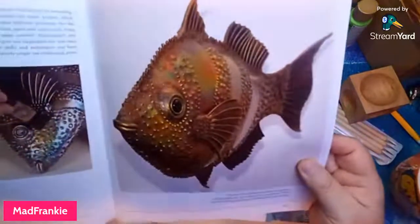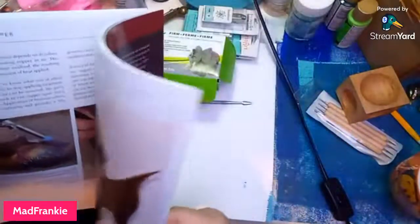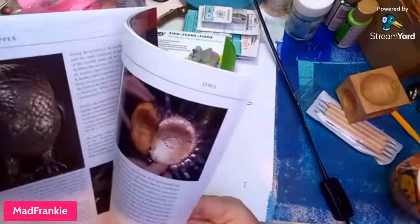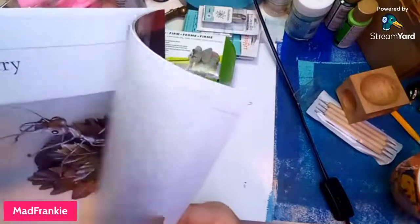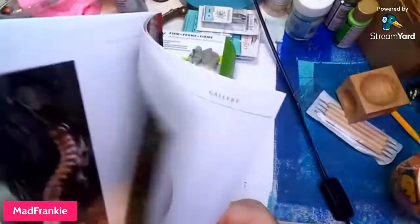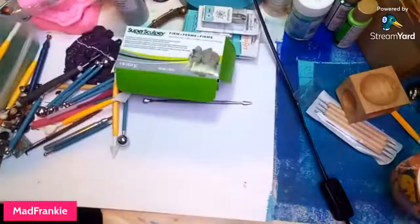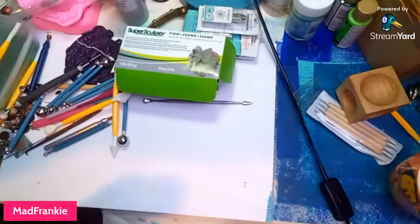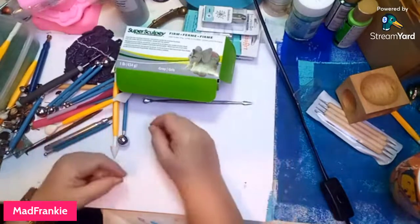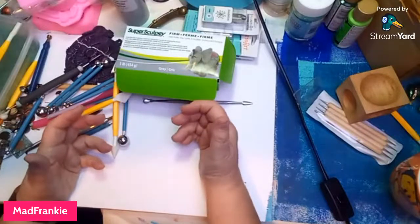Well, I've been cutting out soda cans. I've been cutting them up for the little tin, and I've been pounding and drawing on that, and it isn't easy, not with my hands. So I can't even imagine the aggression you must have to pound. Oh, copper. If you keep it annealed, if you keep re-annealing it, it's really soft to work. It's not so bad as other metals.